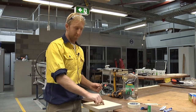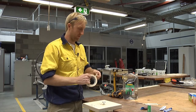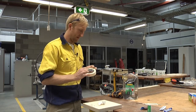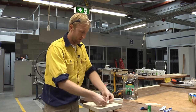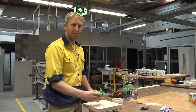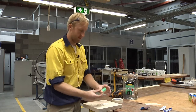We've got this jig here which has got some holes drilled into it, so it lets you place your part in there like so. Take some masking tape — this is what's actually going to hold it while the epoxy cures. Just place two pieces, one piece there and one piece there. Push the whole assembly part down so it's flat. Now take your tube and place it on, then lift it back off — just in case there's any air caught in there. Then we're going to check it with an engineer's square to make sure it's square to this base, so on your tube goes.